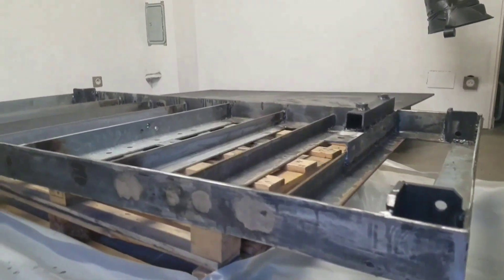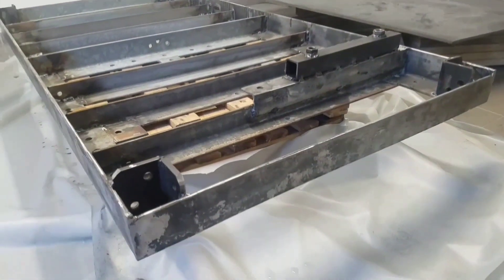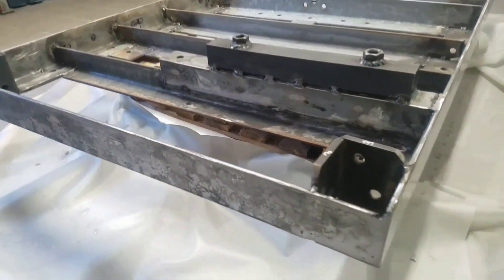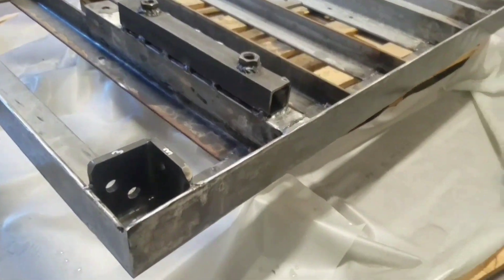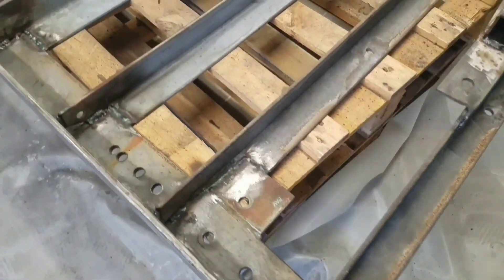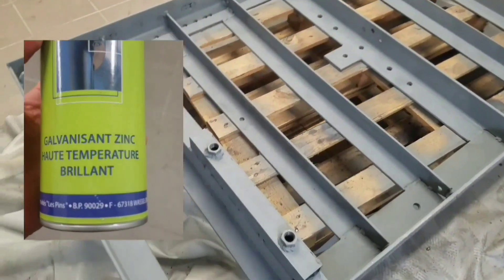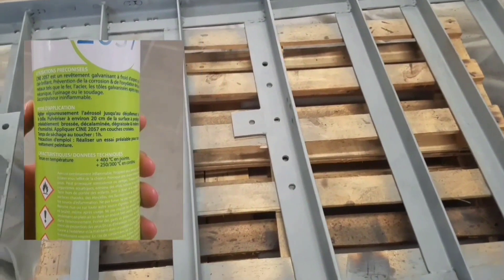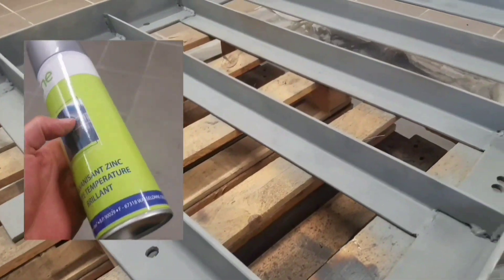I didn't film the placement of the foot plates but it's very simple. I put the table perfectly level, placed the feet also perfectly level, shimmed them, applied the clamps, and used it exactly as-is — it worked great. I used screws from the top so I was sure everything was perfectly aligned. I had to run a tap through because there are always small deformations, but despite that it went great. For the underside I chose to paint with a galvanization spray — it goes very well and quickly in a can, giving access to all the recesses, so it was more practical and looks clean.